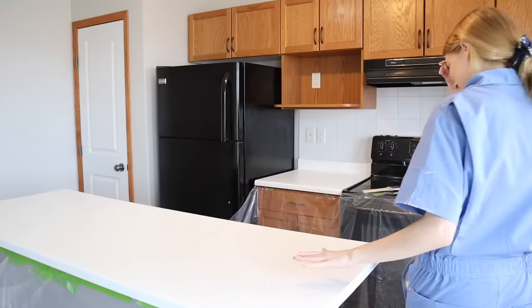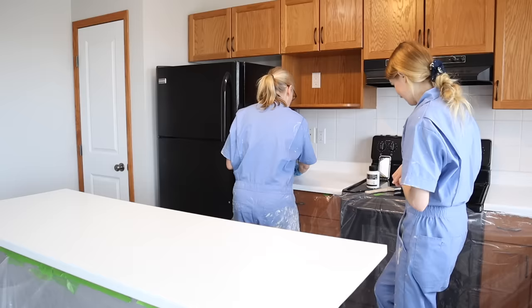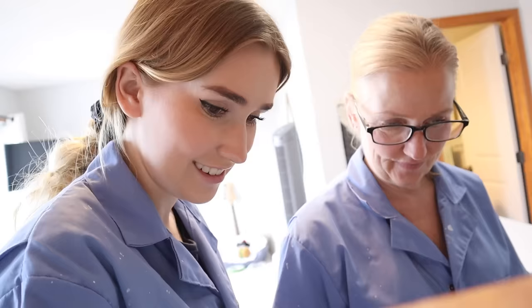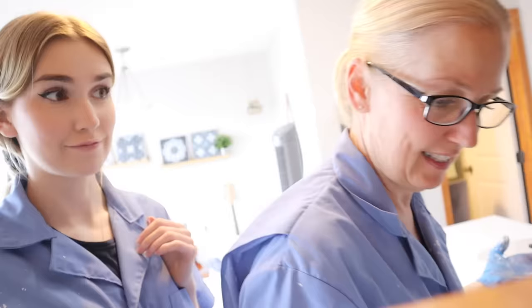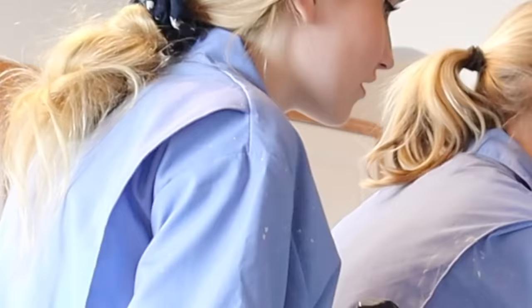Serious business — we're going to try and do the painting of the veins. We're very nervous. We're going to test right in this corner where no one will see. We have a picture of my countertop as a reference. We're thinking directionally this way on this counter, and then a continuation on the other section. Spray quite a bit of water in there — we'll try and spread it out.